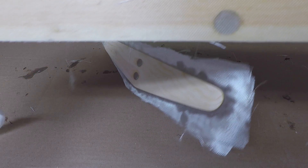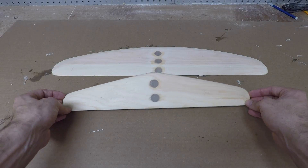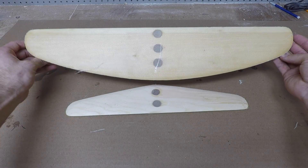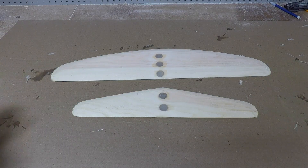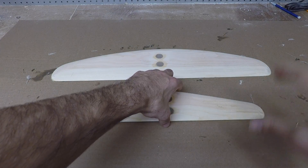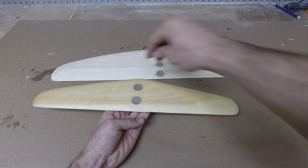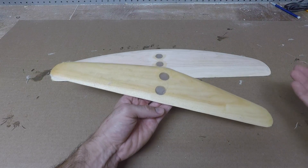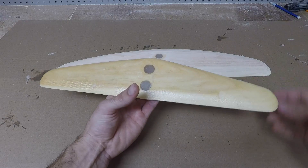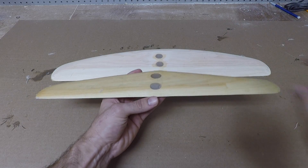You can get right up to that edge — it's a pretty easy way to trim. With the razor blade I went around all these edges; you can see it's glassed right there. The edge is nice and trimmed on the large wing too. Now I'm going to fiberglass the other side just like the first side, but keep in mind: once this side gels up like it did when we trimmed the edge, you'll flip the part over and pour what I call an epoxy rail — a term from board building — that goes all the way around the part to seal the edge and join the two fiberglass sides together.